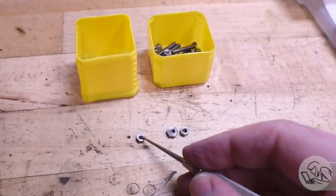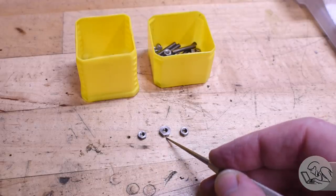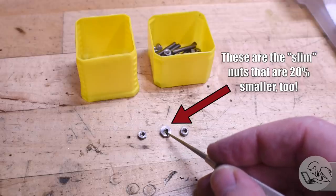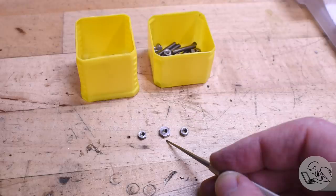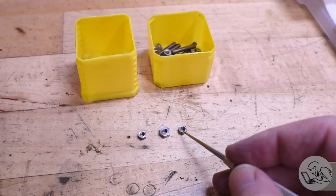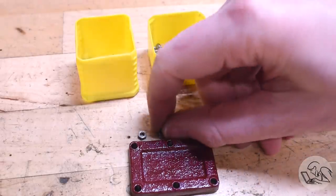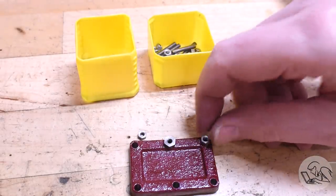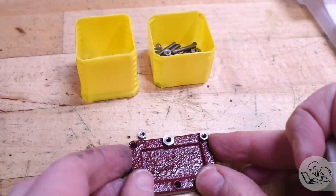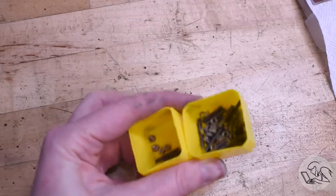Let's talk about scale nuts for a moment, because there's a proportion problem that happens when hardware gets really small. In the center here is kind of what a commercial 5-40 nut looks like, but you can see how the walls of it are too thick — they don't look like a large full-size nut that's been scaled down. Here is the same 5-40 thread in a smaller hex profile, and you can see that it looks more proportionally correct. On the left is a 4-40 nut with the same hex profile. The commercial nut in the center there is proportionally too large on the steam chest cover — it looks weird, it kind of sticks out on the sides, and it just doesn't look like a scaled down nut. It looks like a toy. So that's why instead of using commercial nuts, I went ahead and made all my own nuts out of stainless bar stock.